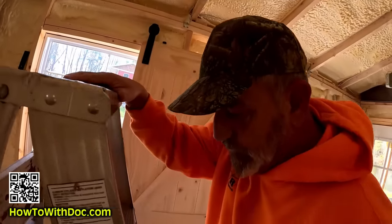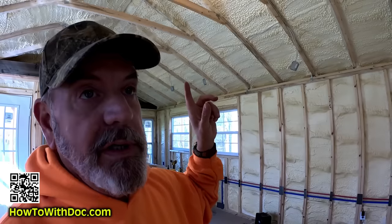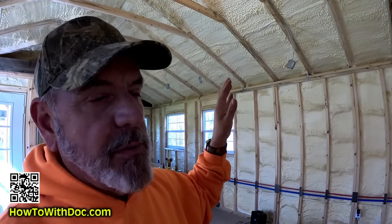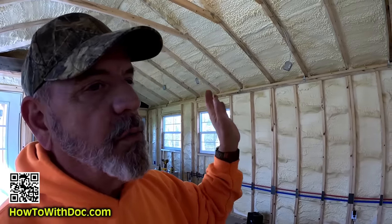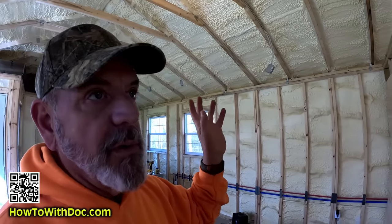You're going to do this because sometimes you won't be able to reach them once the sheetrock gets up — you may not be able to reach in and actually see that switch. So if you have these pancake lights and they're being installed, ask your installer to switch them to whatever you want. The majority of these lights should probably be somewhere in the middle to the warmer side. Can lights typically look better warmer unless it's a very contemporary setting — then you want a bright white.